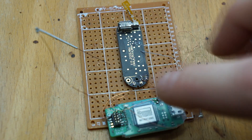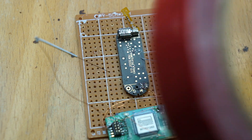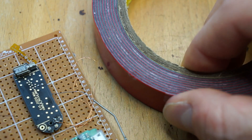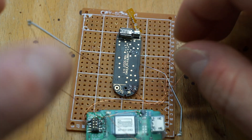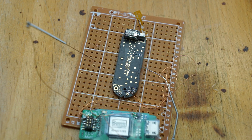This is basically the whole solution: you have this tiny PCB where I glued on the Segger adapter and the PCB itself with 3M scotch tape — a double-sided tape that's a little foamy and very tight, so the thing isn't moving at all. Then with the app running, you can connect to each of these points and try every combination.